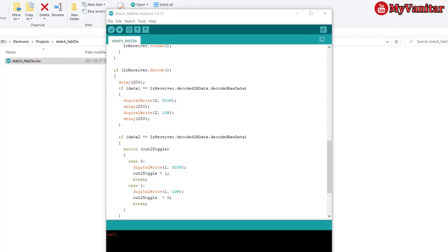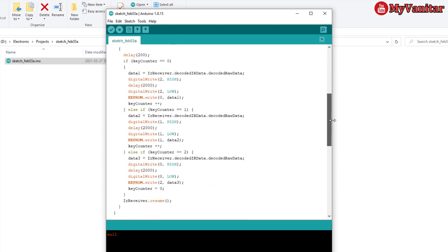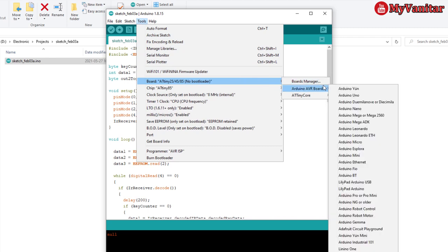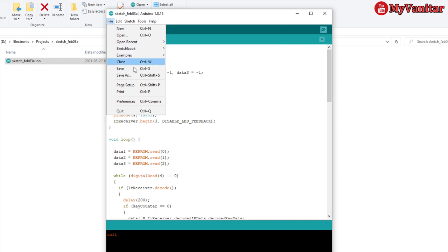In this section I'll briefly explain the microcontroller's code. I've used the Arduino IDE version 1.8.15. Because I've used an ATtiny-type microcontroller, we cannot use the conventional default Arduino boards listed here — we need to install the ATtiny core instead. To install this custom Arduino board, go to the File menu and then Preferences.